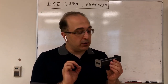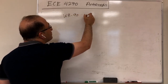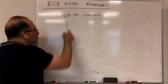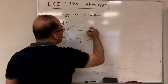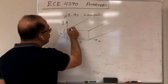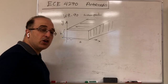This is a WR90 waveguide. It's a metallic structure with a rectangular cross-section — essentially a hollow metallic tube of rectangular cross-section. This structure is used to guide electromagnetic waves within it. As you can see if it's rectangular, I have two important dimensions, A and B.